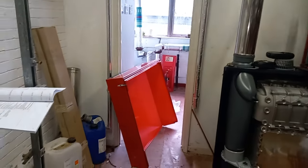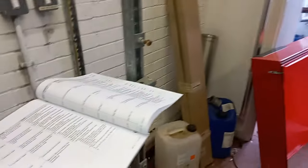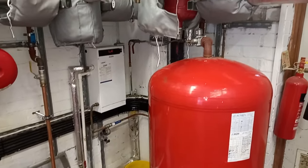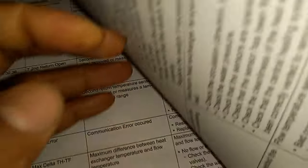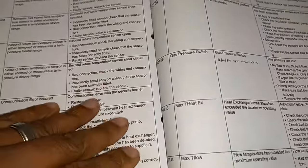Hi, welcome to the Commercial Gas Engineer channel. I'm just wiring up a boiler and commissioning it. In the process I've had a few fault codes. The first one was a blocking fault because the pressurization unit over here was not satisfied, so I got a blocking signal. And the other fault — let me check — I'm on the GAP one at the moment.